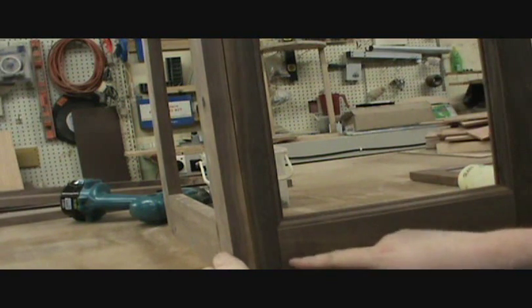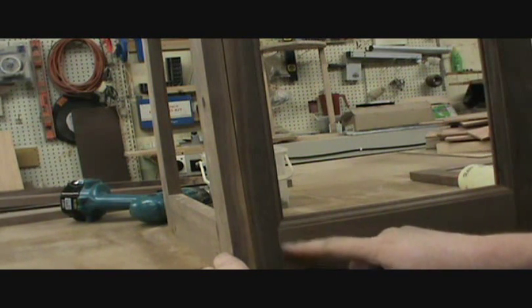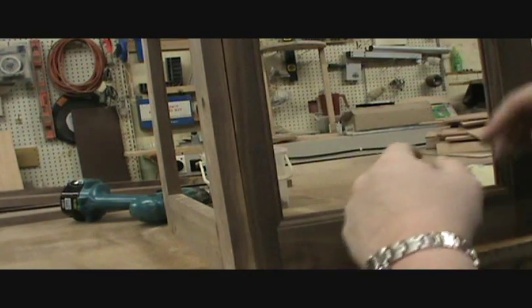So then that looks like a 2-inch board. And down here, I learned a long time ago, I don't go smaller than 3 inches on anything on base. The reason is, at 3 inches, you got 2.5-inch clearance because you got a 1/2-inch overlap for the door. Otherwise, if you go smaller than that, you're smacking your toes with the door. So, now that I got this made, now I know the size of the panel I got to make for the raised panel for this. So I can make my raised panels and put those together.